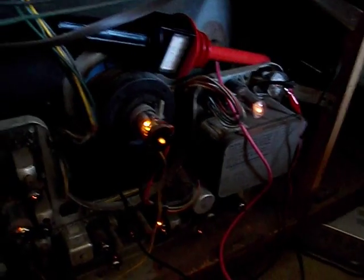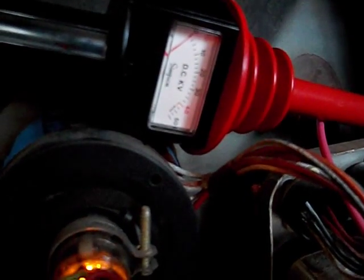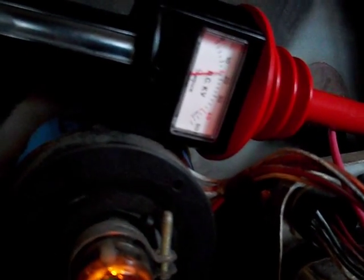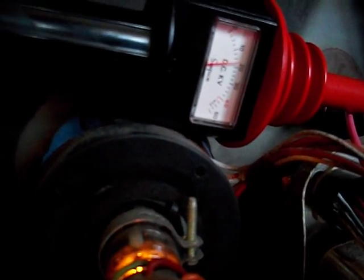Here we go — I'm watching the high voltage. There's a little pop and snap in here because the probe is just kind of resting on it. This is the high voltage that comes from the flyback. I did disconnect the ground lead just to see if letting it float would have any effect — and it still works just fine. We're coming up to about 18 to 19 kV.